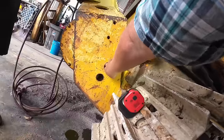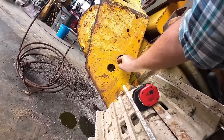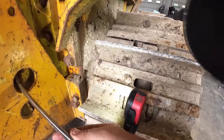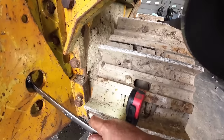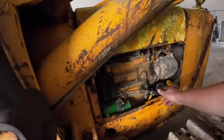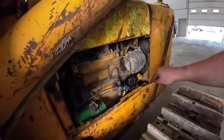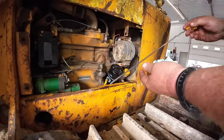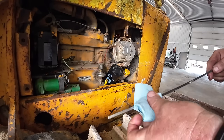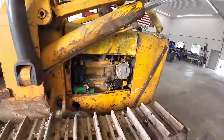That's not gonna fix it, is it? Would you get a quart in it, maybe? Got about a half right there. Well, I'll start it up here and mess with it a little bit more, but I don't know if she's going to work. I'm guessing we might have some issues with that. I'll get a good baseline on the oil here. It's been sitting here for about 15 minutes. Right there, the top of the little arrow's about 3/32 over full. We'll keep that in our brains. Check it after we run it a while and make sure she's not adding oil.